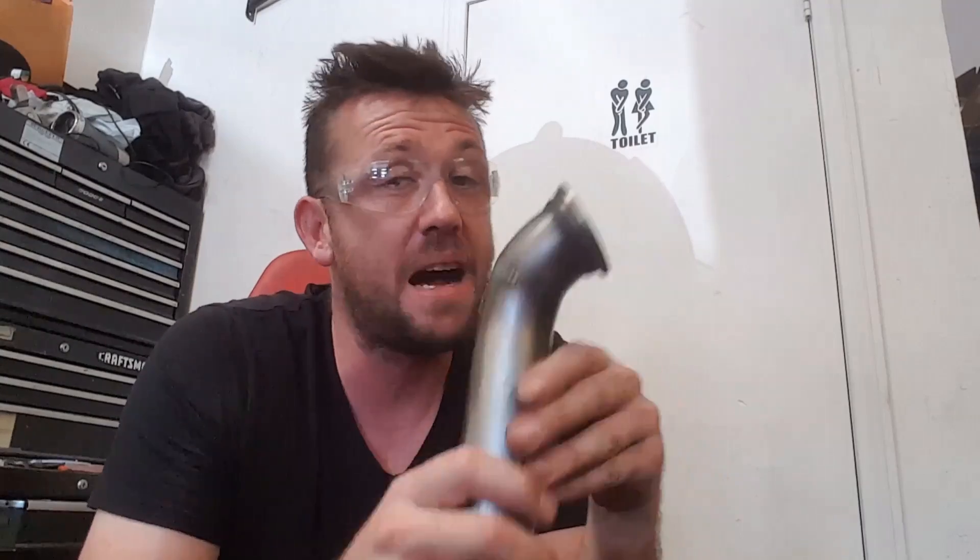When it's solidified, it's not strong — it's very, very weak — and it contaminates your weld. To put it in layman's terms: the outside of the weld looks great, the inside of the weld looks terrible because it's got all those little sponge-like holes in it. So that's literally about half of the weld holding this piece together.